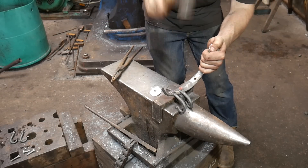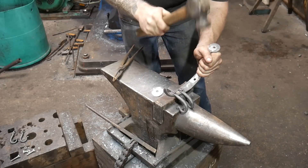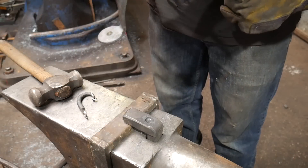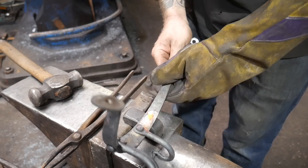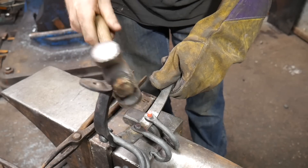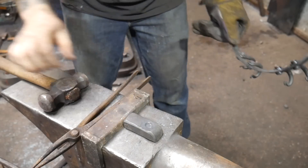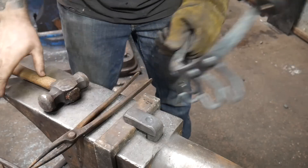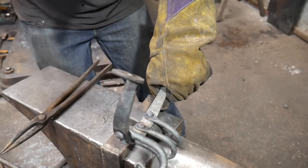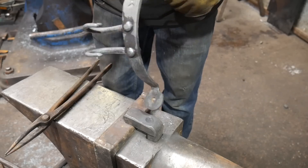It's at this point in the video that I was working through the process of riveting these up and realized I didn't have the right tool for the job — and this is almost exactly the same thing as with the tongs. If you haven't got the right tool for the job, it's going to cause you problems. Sometimes the easiest and simplest answer is to make a tool. I've used an extra piece of steel here to raise the height of the riveting tool, but as you can see I'm struggling. If this is something you wanted to do regularly, it's genuinely probably better to make the right tool for the job. Making tools will get you out of a lot of situations and save you a lot of time, hassle, and headaches.